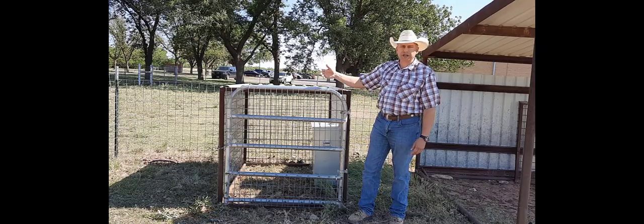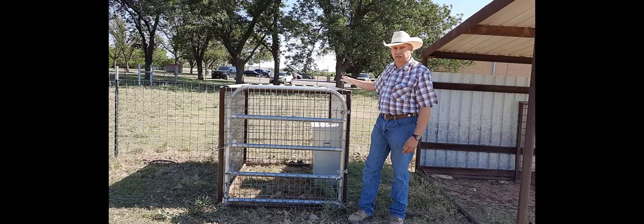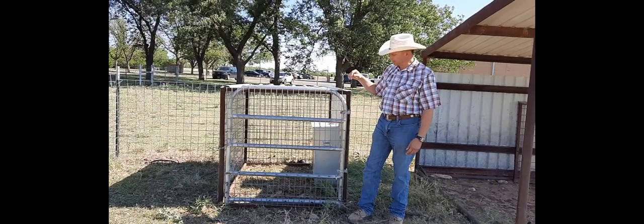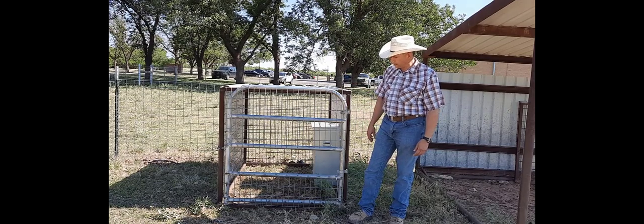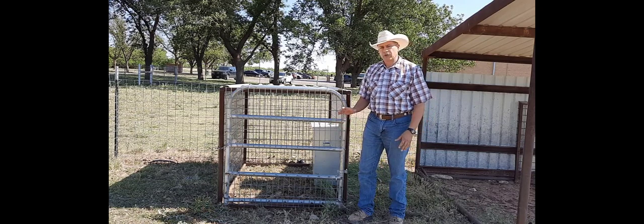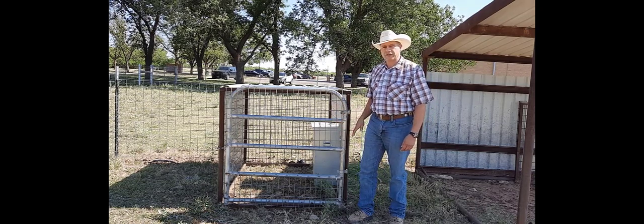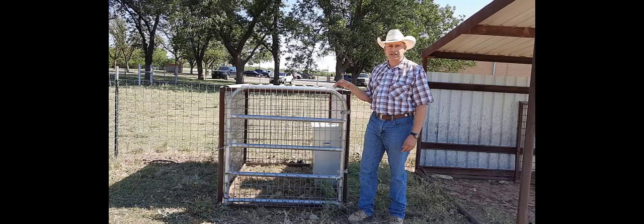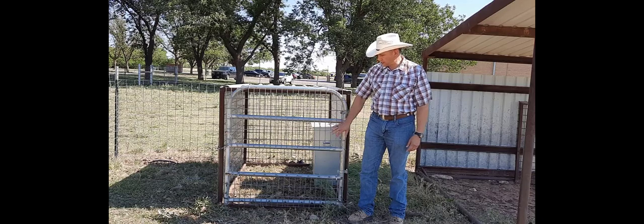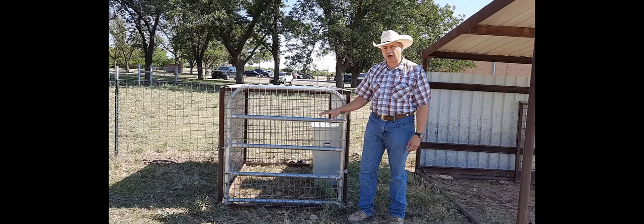The front and the back of the feeding station are four feet square. The feeding station is six feet long and it has four by two welded mesh all the way around it. I would recommend that you add a floor to this unit if you're going to use this design. We had some issues with hogs at the Ranch in Menard actually digging on the side of it and then going underneath to get inside to get the dog food, since they are unable to jump through the third section when we have it set up like that for the dogs.